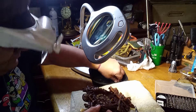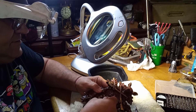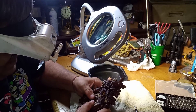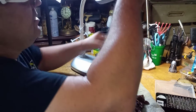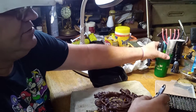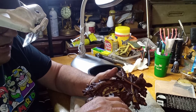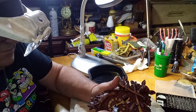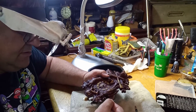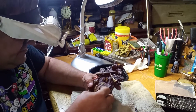I need to put the hands where I want them. Sometimes when you take these hands off the Luxe clocks you might damage them. I find that a hand puller does not work well. What does work — but you have to be careful — is to use a pair of dykes: put them between the minute hand and the hour hand, squeeze, and the minute hand comes right off.